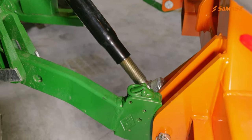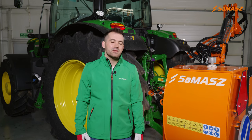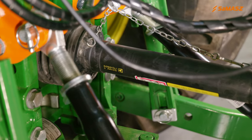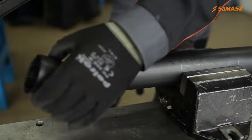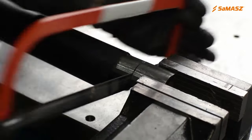Remember, after setting them up your three-point hitch should be fixed. You shouldn't raise the lower links because doing so can damage the tractor. Once the machine is mounted and the stabilizing bars are adjusted and set, the next step is to install the PTO shaft between the machine and the tractor. The length needs to be checked first and if necessary the PTO needs to be shortened. Too long a PTO shaft can cause damage to the machine and the tractor. Detailed instructions on shortening the PTO shaft can be found in the operator's manual.